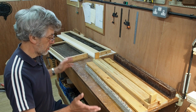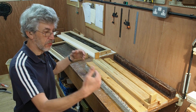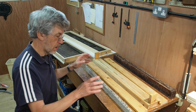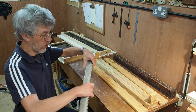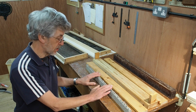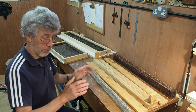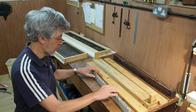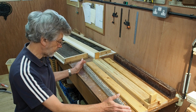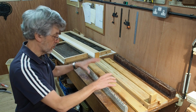Now, a bit of a word about the masters, the original model that I used to cast the rubber to then cast the concrete. The first one I did, which is for the wall, because the wall sections were what I wanted to get going on the railway, because I'm going to need a lot of these. Now, in hindsight, the experience of having now done a couple more of these, this is completely the wrong shape to be trying to mould anything useful. Because it's long, it's deep, and they're relatively delicate.